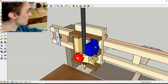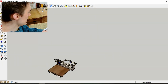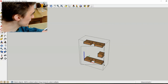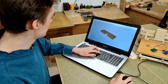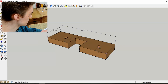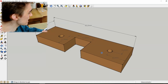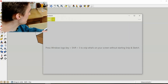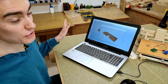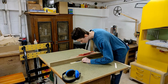The way I usually do it is by navigating to and copying the part I want to fabricate, then I just plunk it into the middle of nowhere where nothing else gets in the way, hide everything else I don't need, and start adding all the dimensions. Once that's done, I look for a perspective where you can see pretty much everything that's going on, and then I simply take a screenshot. Then I send this screenshot to my phone, at which point I can finally start fabricating the part — I just need to look at my phone and set the table saw to whatever I want to cut.